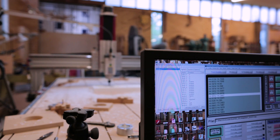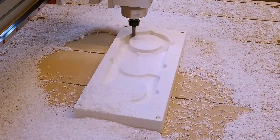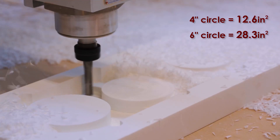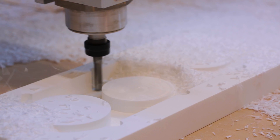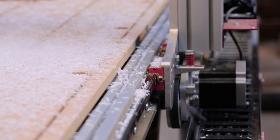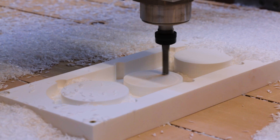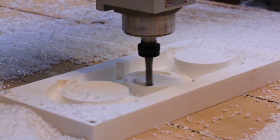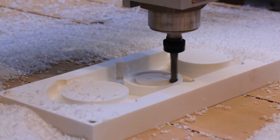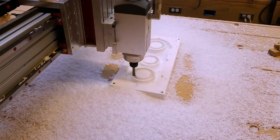The thought with the two hoses is that I have a six-inch dust collection pipe running to this. And if you do the math, two four-inch circles is actually less surface area than one six-inch circle. So I can sort of preserve that six-inch pipe by having the two four-inch pipes. Then I can cut the holes within the circles. This plastic, when you cut it with the router, doesn't seem to make the real fine dust like wood does — it seems to make all similar-sized chips, so it made a big mess but not a lot of stuff floating in the air.